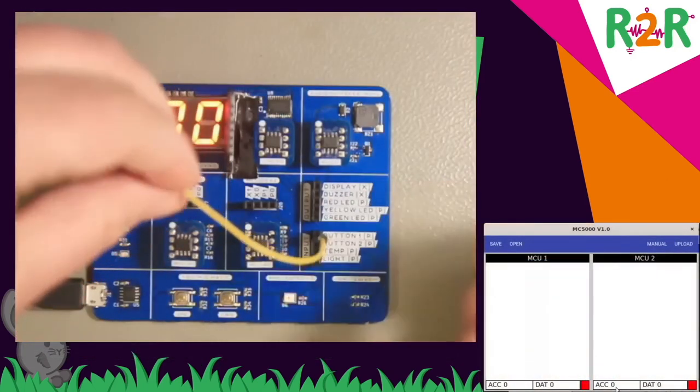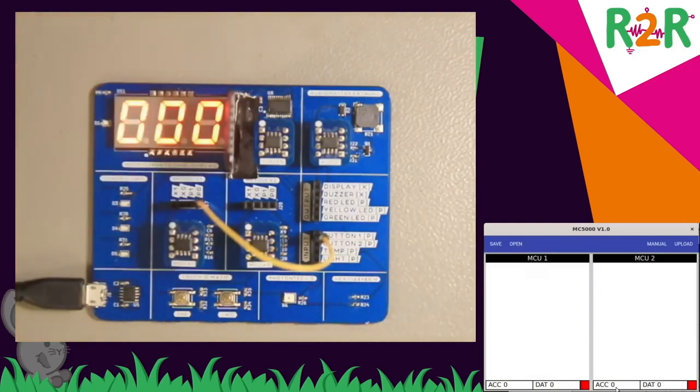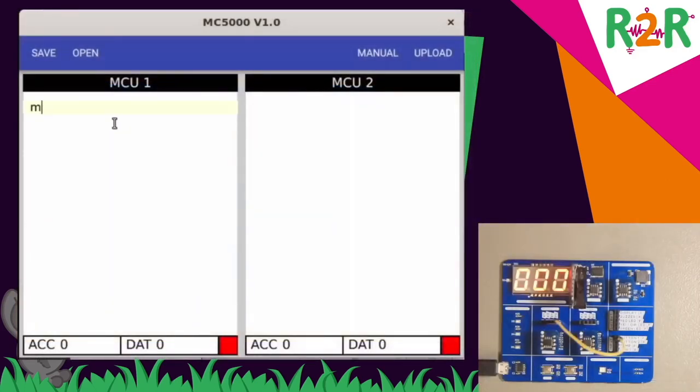Now I'll connect a button with P0 of the first microcontroller, and I'll write the value that is P0 into the ACC register. I'll press upload. The program has run. ACC shows zero. If I press the button now, ACC goes up to 100. So the program runs in a loop